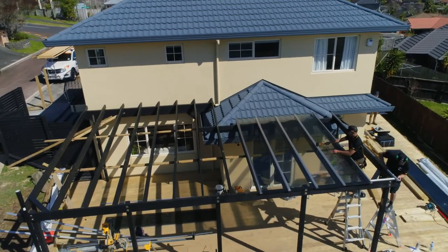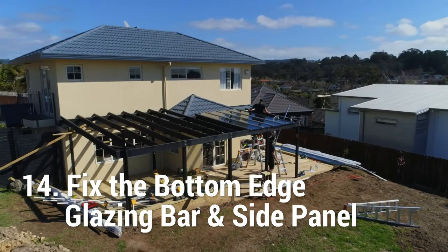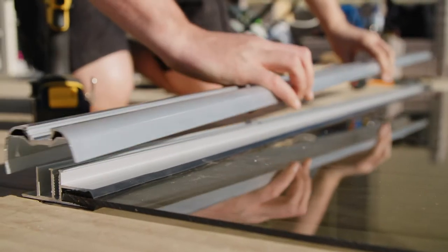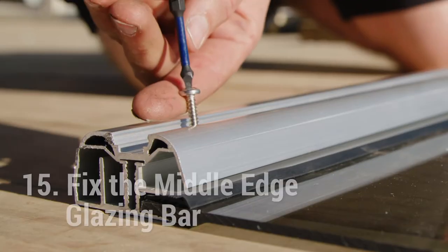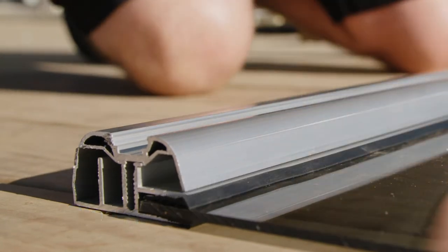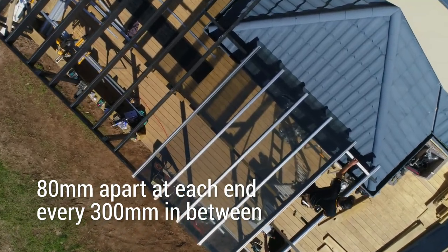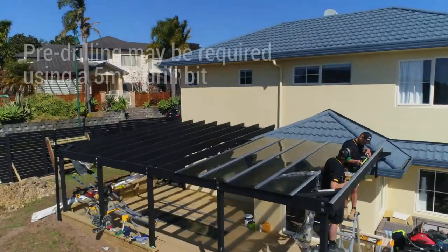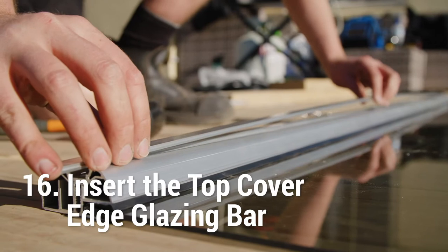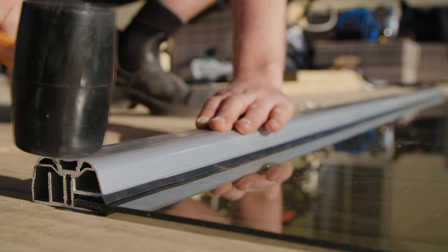Place the bottom edge glazing bar along the end of the structure with the side panel and fix the bottom edge glazing bar onto the rafter or purlin using the screws provided. Position the middle edge glazing bar onto the bottom edge glazing bar and the edge of the panel. Fix the middle edge glazing bar with the screws provided through the pre-drilled holes and into the bottom edge glazing bar. It is recommended to position two screws at 18mm apart at each end and then at every 300mm in between. Pre-drilling may be required using a 5mm drill bit. Click the top cover edge glazing bar into place on the top using a rubber mallet, performing moderate strikes with short intervals.